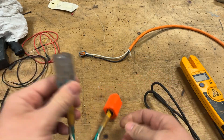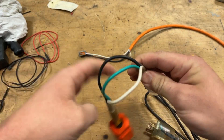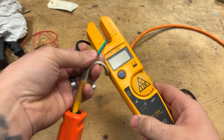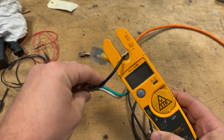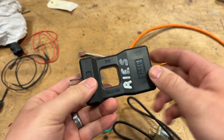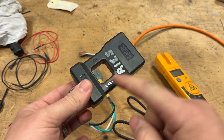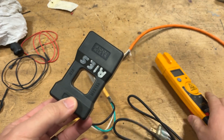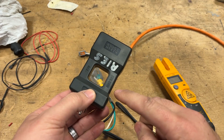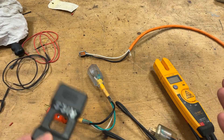You just plug this into the wall, plug in whatever you're plugging in, and now you have three conductors sticking out that you can measure. I can measure neutral line current, check for ground faults to see if I have any current on the ground, and monitor my hot while it's running. And I don't have to do any math. You see this '10 times' marking on the Klein? Whenever you get a reading off of it, there's a coil inside that makes you have to calculate the actual amperage — whatever you see on screen isn't the real number.